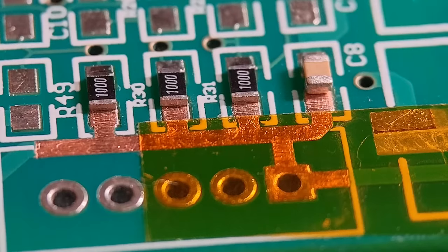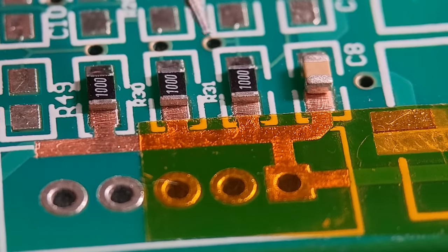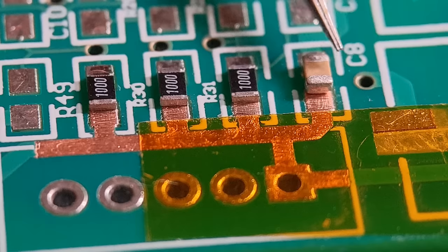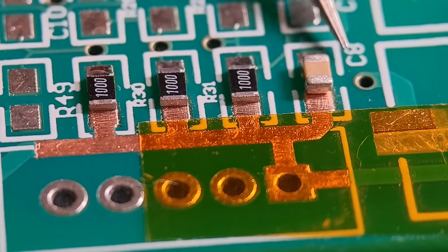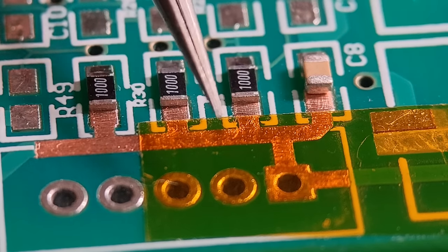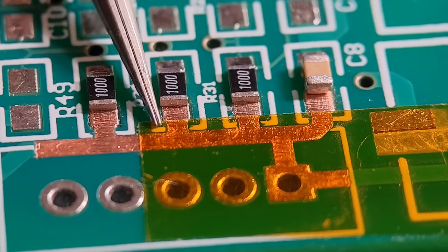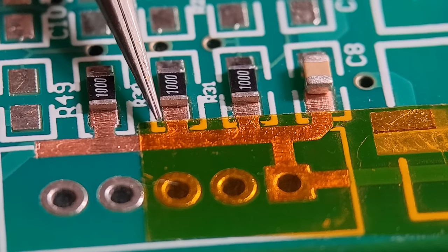Just to speed the video up slightly, I've tacked the components in position. I've got three resistors tacked in these three positions, and I've actually fitted a capacitor up the end there — C8 — because that's what it's asking for, just to keep it in line with what it should be. I've also put the Kapton Tape across the front three points, where the resist would normally do its job, but I've scraped it off just for the sake of the video.